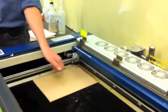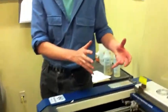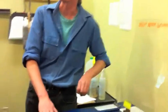You see all this paint that's been etched off the rulers? That is from when people trusted the home position and somebody who had been working on it before screwed up the calibration, and the home position was actually set back over the rulers.